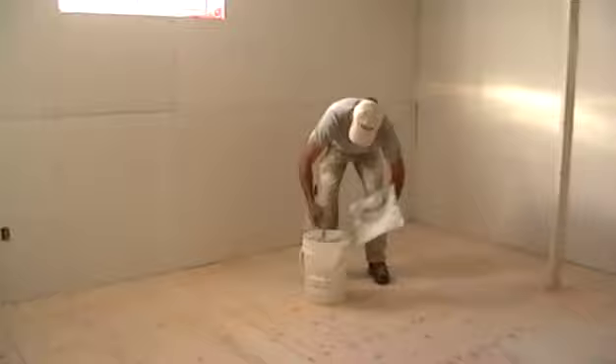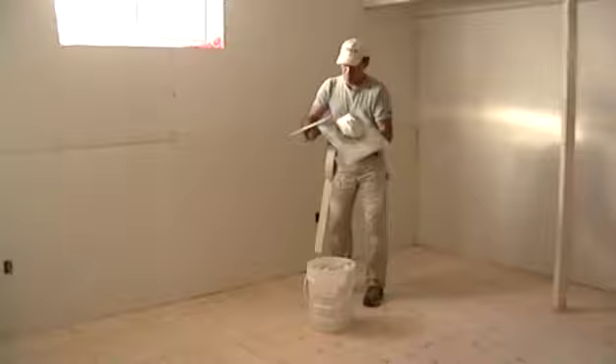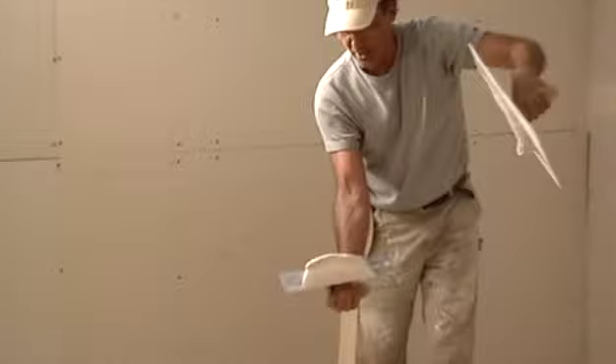We'll scoop some mud from the pail - this was transferred from a plastic lined box. That's enough to work on a couple of these drywall joints. I gave it a little shake - there's that suction cup thing again. Mud control matters; it makes your life easier. Front hand on the trowel, upside down, load up the center - that's how much mud sits on there. Turn around, start at the top and come down. That's loaded up. I laid my trowel flat to leave the mud there.